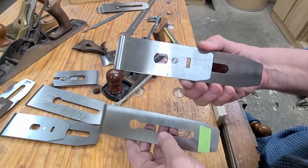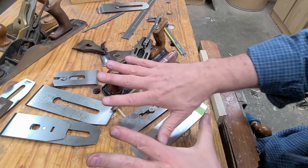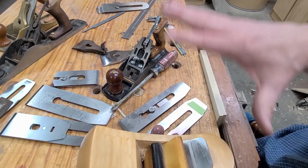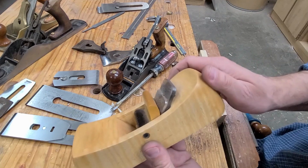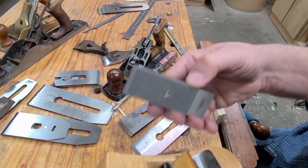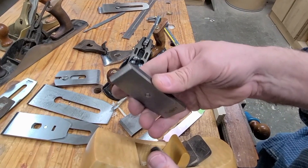These are the three main brands of plane blades for bench planes. A kind of rite of passage for hand tool woodworkers is first making your own bench, then making a functional hand plane. This is a Krenov-style hand plane — one of my favorites, but it takes a special iron. You can use Hock blades for it, getting the blade and chip breaker. I really like a chip breaker with my planes to help break up chips, but this Hock setup is about $100.